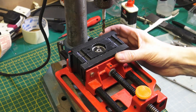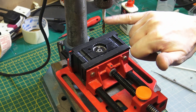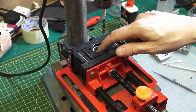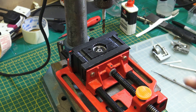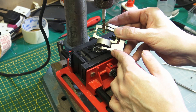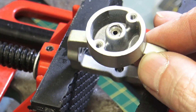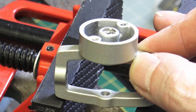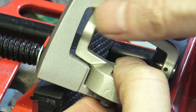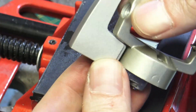Here's the pillar drill. I have a 5mm drill bit in there, which I marked with some tape so that I can always put it back in the right place. It's very important that we don't drill too far into the bottom of the pivot. If we go too far, the pivot will not move freely, because it will be resting on the L-shaped bracket that it rotates on. Here we can see one of my previous attempts where I'd actually drilled too far, and the bearing is recessed too far down — when I put it into the L-shaped bracket, there was no gap around the base, so when it moves it's going to rub against it.